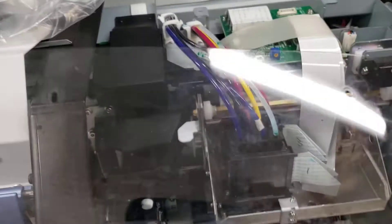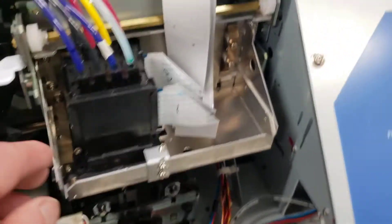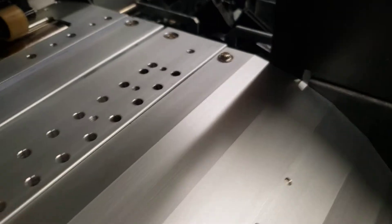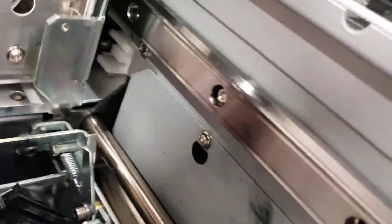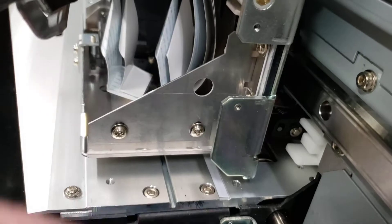To get it all apart: take the front off, take the back off, lift the top over. The plastic is held on with a bunch of screws. You'll have to move the carriage out of the way because some screws go in sideways — you have to come in at an angle. There are a couple of other screws that go in a different direction. Slide the carriage over to one side to access the two screws on the back that you can't reach otherwise.